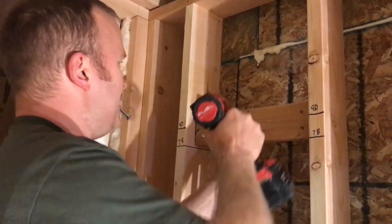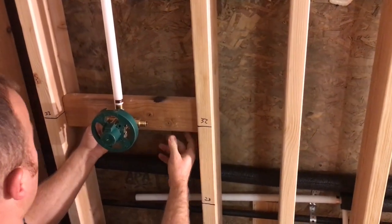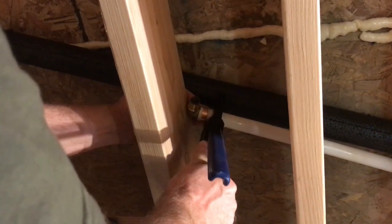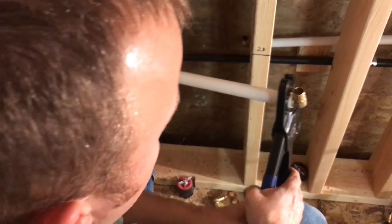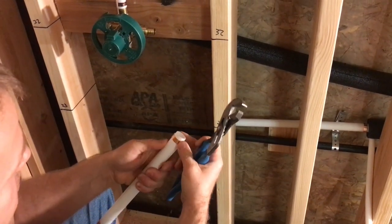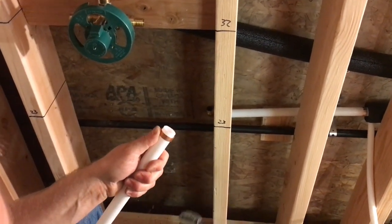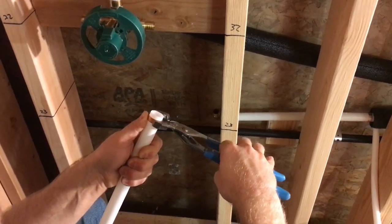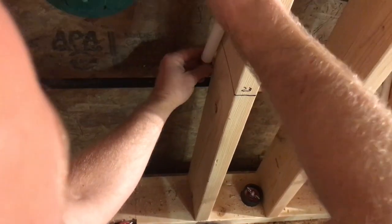Alright, we're gonna plug it in. Oh shoot. These rings always slide up and down like this when you're going to put it on, and so I like to get it — it's supposed to be within an eighth and a quarter. So I do about three sixteenths, and I give it just a little squeeze. And now it don't want to go nowhere. And then I can just push it on there, just like that.